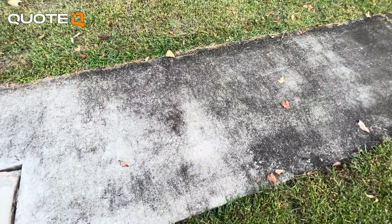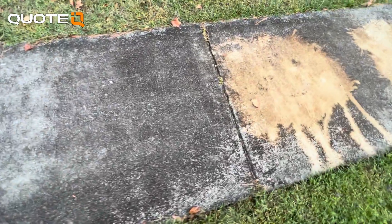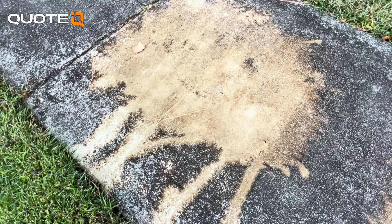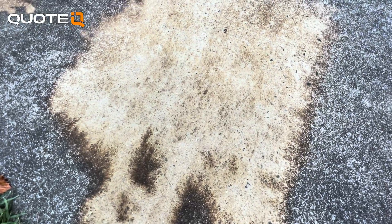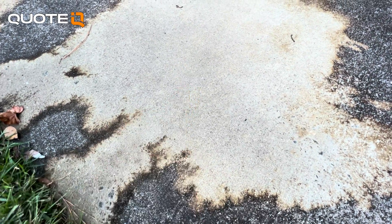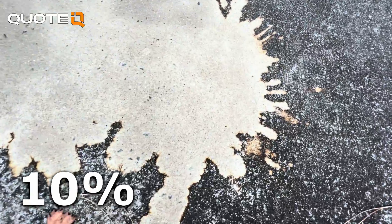We came back about two hours later. The concrete is still a little wet from the SH. The one and a half percent did a pretty good job — you can still see some organic growth, but it definitely lightened it up and after rinsing it's going to be tremendously better. The three percent did a much better job — it lightened it up a lot more and I can see no remaining organics except where it wasn't applied evenly. The five percent looks like pretty much pure clean concrete — that discoloration is just the concrete, not organics. And the straight 10% — it's a night and day difference.